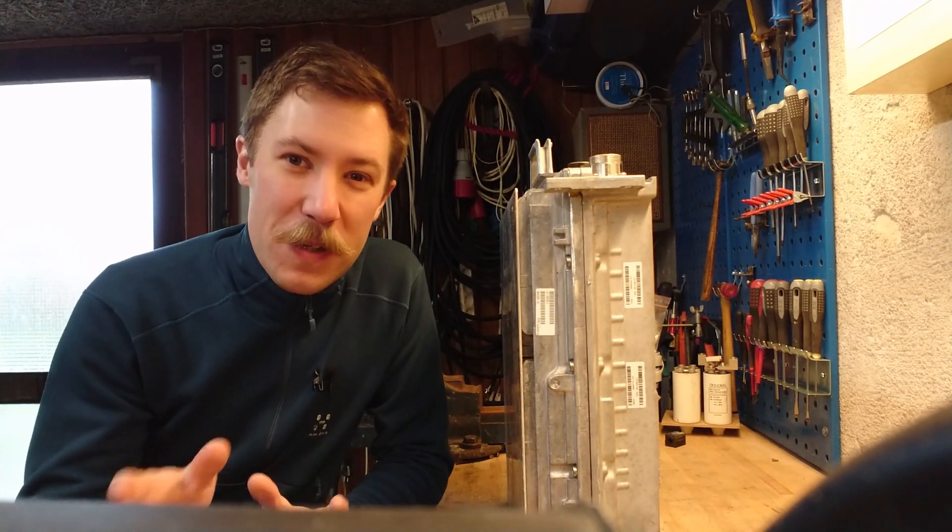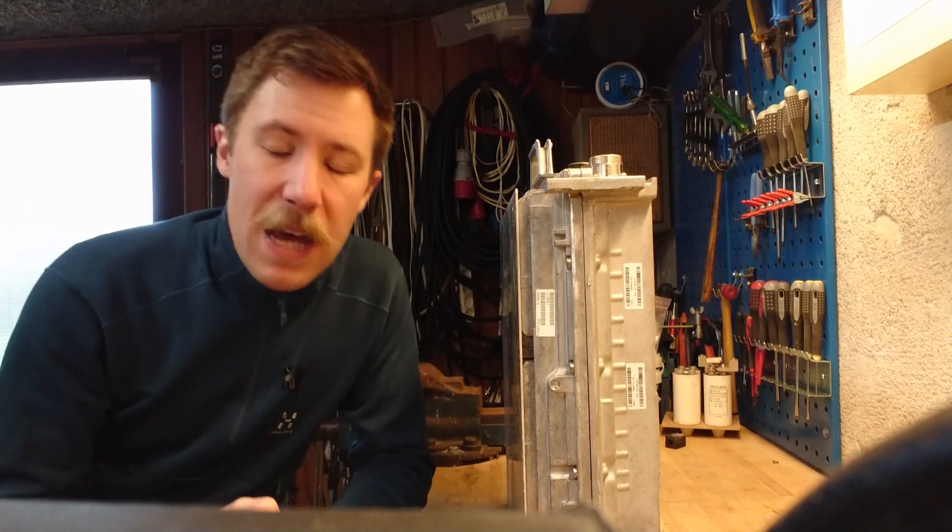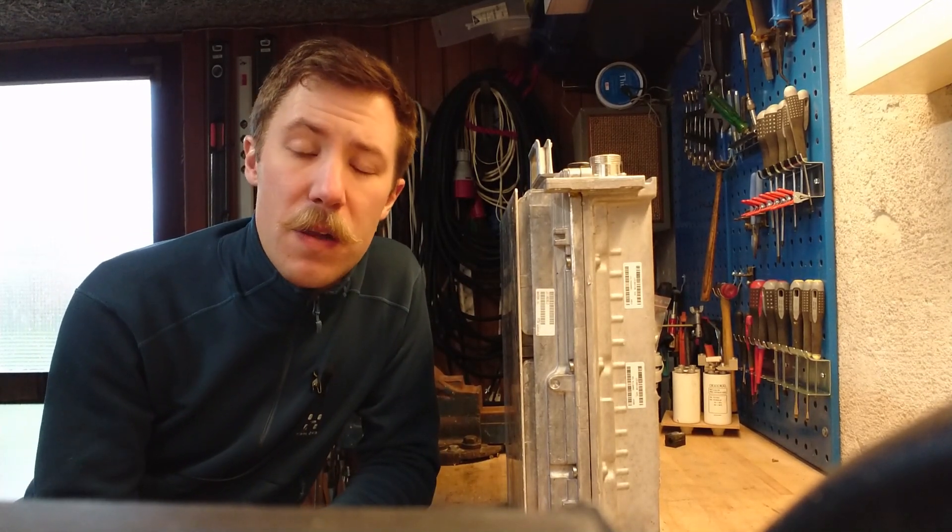Hi all, Mads Barnkopf from Kaiser Power Electronics here. Today we're taking a look at this Nokia Siemens Multi Radio Flexi Base Station System. This is quite interesting because I have previously taken apart the FXE-B, which is a 3x90W amplifier. This is another model of that same series — the FXE-A, which is a 3x70W amplifier, but it has software-tunable front-end filters. So I guess that means we will see cavities that are tunable by small servo motors with small plastic parts with copper surfaces that can move back and forth to tune the filter.